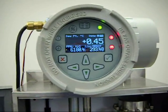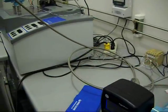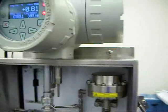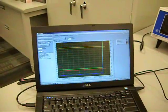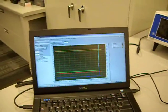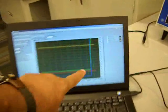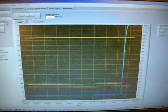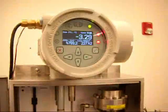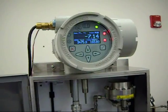It's actually still going up — it'll take a while to purge the sample line. We have about six feet of flexible tubing as the sample line. At the same time, the data is also being logged and graphed on AuroraView software, which is connected to the Aurora by its RS-232 interface. You can see over here that spike representing the increase in humidity, and already we can see that as we switch back to the dry gas, it's starting to dry down.